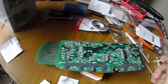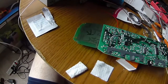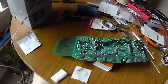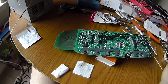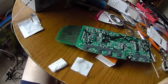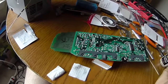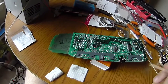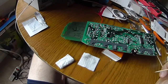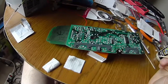Your board may be different, so don't take my word as a clear sign that this is how it's supposed to work, because yours could be completely different. The Gentex 313 with the Compass module has a completely different board and does not carry over the same approach of LED installation. You're going to have to trace the circuit, actually understand how it works — it's not going to be just a drop-in couple of LEDs and resistors. It's going to take work, but to me it's worth it. It's been a fun project.